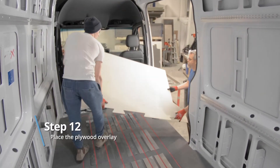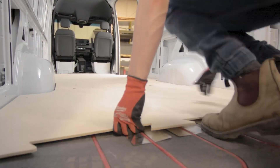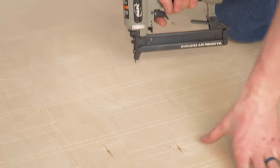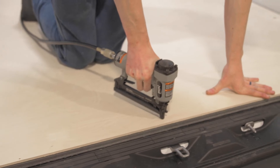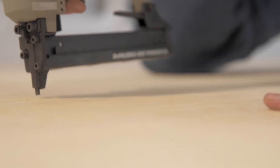Place the plywood overlay on top, matching it to its foam underlay — no gluing is necessary. Using the engravings as a reference and utilizing three-quarter inch crown staples, fasten the overlay to the underlay. The engravings show you where the PEX and heat transfer plates are located to avoid puncture. Make sure not to create high points at the seams. We advise making any penetrations before covering with your finished flooring, as this mapped overlay will help you avoid puncturing the PEX.